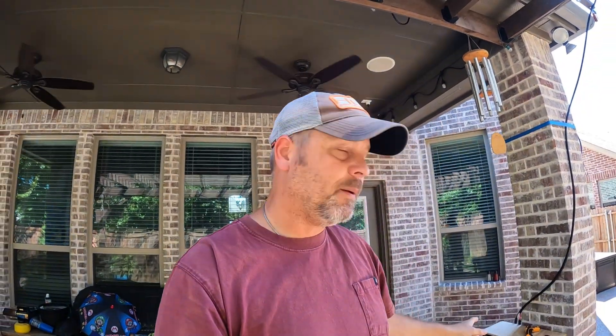Right now I've got a tiny shadow — about five inches — from the mounting bracket of one panel casting onto the other, and it's reducing the output. I'm currently getting 121 watts because of that small shadow. Once the sun comes up just a little bit more, both panels will be completely shadow-free and I'll get much better results. I'm not a solar panel expert, but that's what I've learned in case you're trying to figure out series versus parallel. My battery is now at 82% — it was at 100% last night — so it's been running basically without solar for over 12 hours and dropped about 20%.